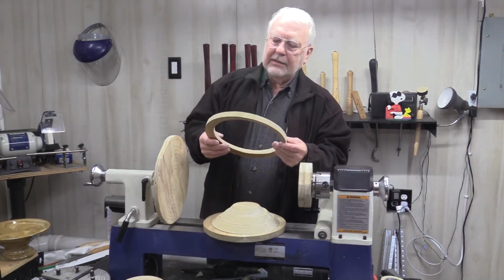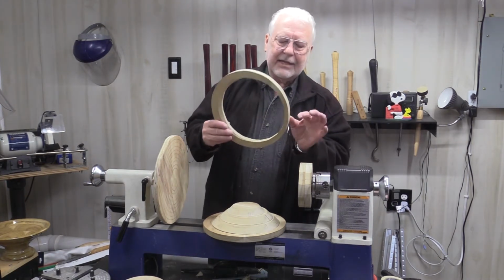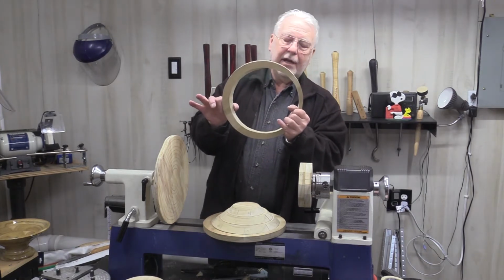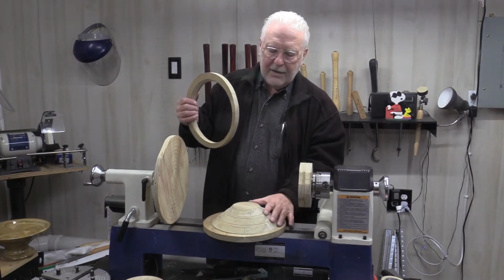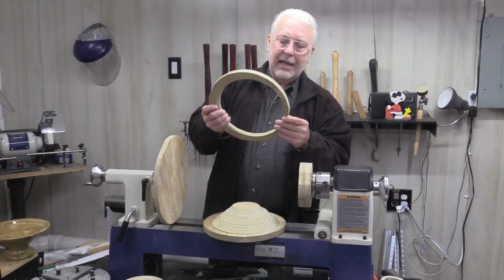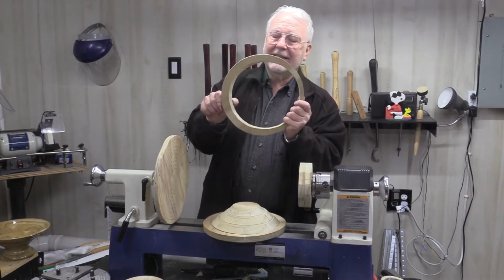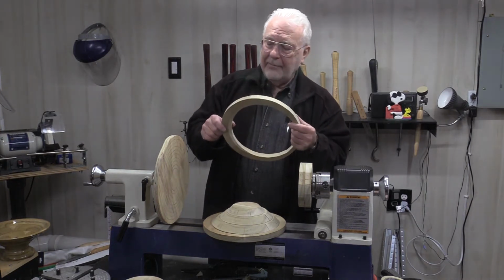And it's a little hard to tell from here, but this is a half inch thick right here and 1 7/16 over here. I told you that basically once you cut the bumps off, it could be 5/8 of an inch thick. Well, if I'm a half inch over here and 1 7/16 over here, that bowl is going to be really thin on one side.